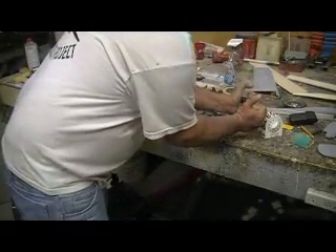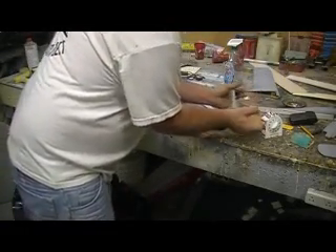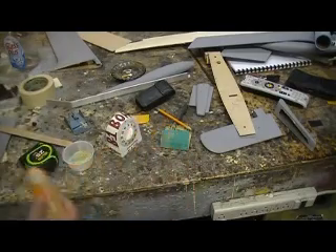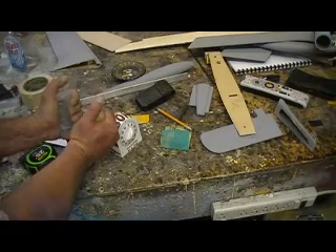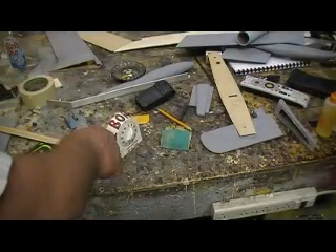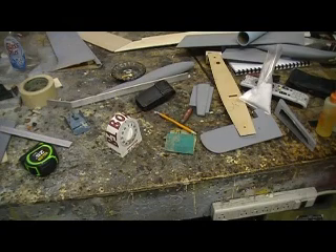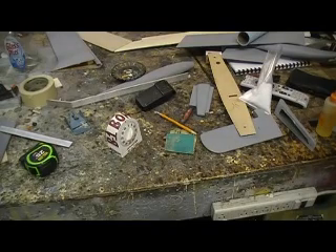Mix for 15 minutes. You know how you can tell — especially if you squirt out a bunch of epoxy — you squirt it, set it down, and look at your epoxy level instead of trying to judge from your mix. That's how I do it. Put a little bit of cotton flock in there — it makes that epoxy stay where you put it. Don't get it too thick though, because if it's too thick it won't soak into your wood and you won't get a good bond.